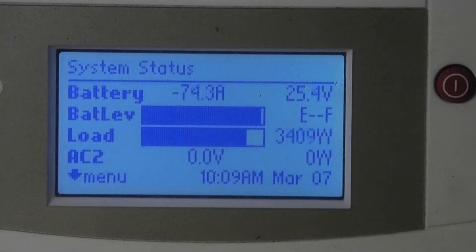Most of the panels are laying flat in the garden in the winter shade. By the time they hit full sun, the car will probably already be charged up. We've certainly invoked the timer that's going to turn this back off because the battery voltage is down to 25.4 volts. It's showing the battery fuller than it was before even though we're actually emptying it, because that 20-amp outside-the-system charge input is confusing its battery fullness algorithm. That doesn't matter to us — we know that if we're showing 25 volts and change, we're not doing any harm.